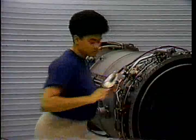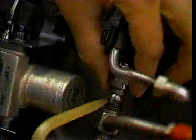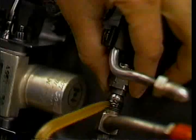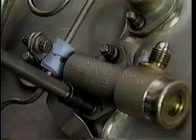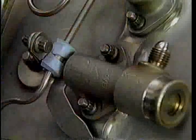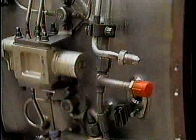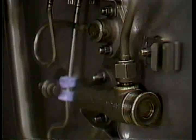Before closing, let's look once more at four major aspects of the installation. Always lubricate the nuts prior to installation. Then, leave them slightly loose during initial installation — the looseness helps allow proper alignment of mating hardware without causing stress on the parts. Afterwards, torque the nuts according to the sequence shown in this program. As part of this, double-torque the coupling nuts that join together the manifolds, as well as the manifolds and spray bars.